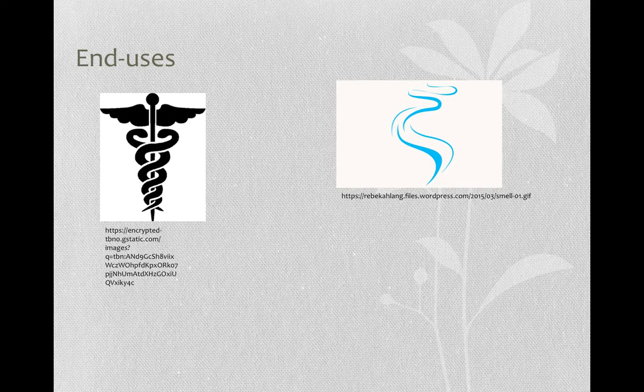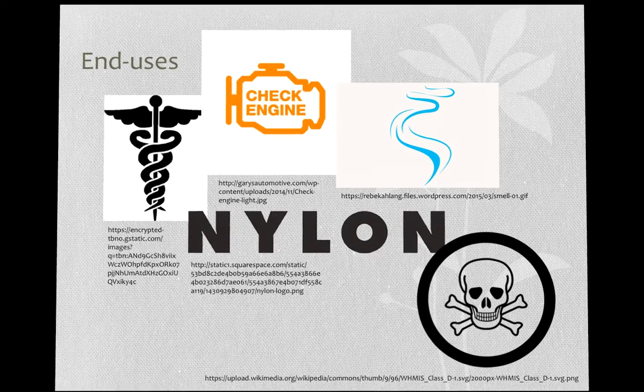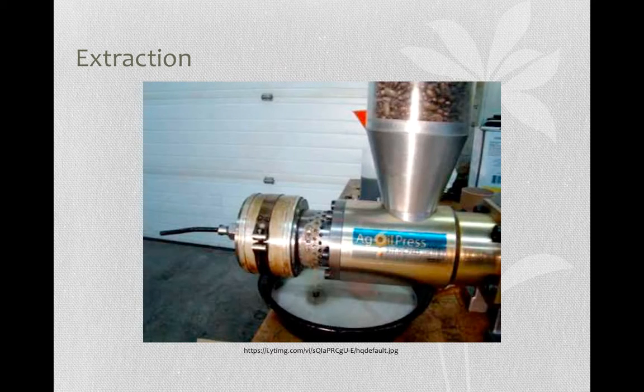The castor bean is greatly versatile with over 700 uses. These involve the medicine, petroleum, and clothing industries. The main product of the castor seed is the oil. The first step in extraction is pre-pressing using a high pressure continuous screw press. Extracted oil is filtered and then collected in the settling tank. Material filtered out is then added to the original material to be pressed again. Material discharged or meal from the pre-pressing is then crushed and subjected to solvent extraction with hexane or heptane.